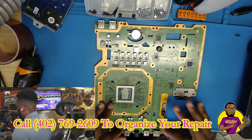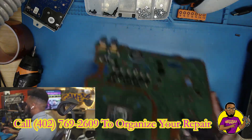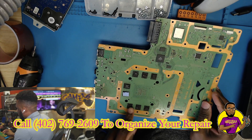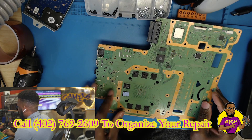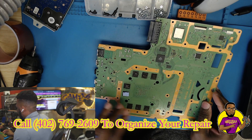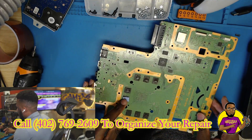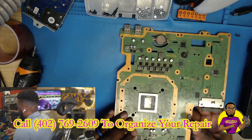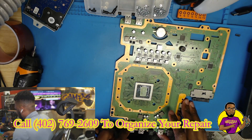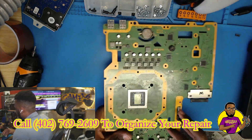We have it down to the motherboard. There were a couple things I noticed from the last repair shop - you can see they replaced one of the thermal pads but they failed to replace the other two thermal pads on the RAM chips. A lot of people might not think that's important, but it does help keep the RAM chips cool. They did it right here but failed to do it for the other two, which is weird.